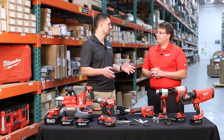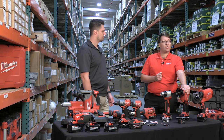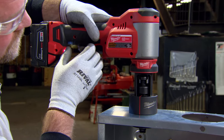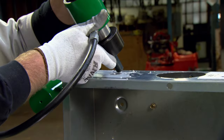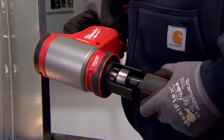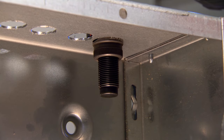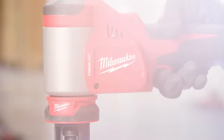Now let's talk about electrical solutions specifically. Our electrical is going to be our bread and butter — that's kind of when we started the company 100 years ago, and it still remains our main focus today. Our knockout comes in two options, both 6-ton and 10-ton, to make sure you're able to cut through any material to get the job done. This tool replaces the traditionally very manual labor of the hydraulic knockout with just the press of a button, speeding up the process and providing great safety benefits. It also has a quick connect stud so you can change out the sizes of your cuts and clear debris much faster with just a small turn instead of threading the cutter all the way through every single time.